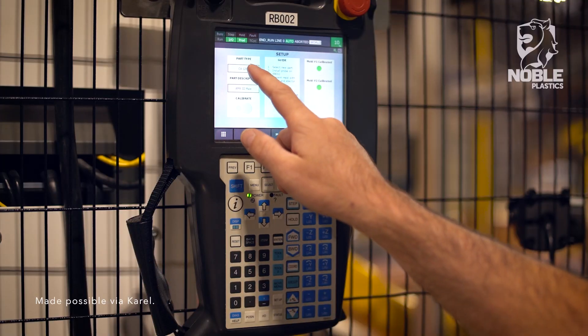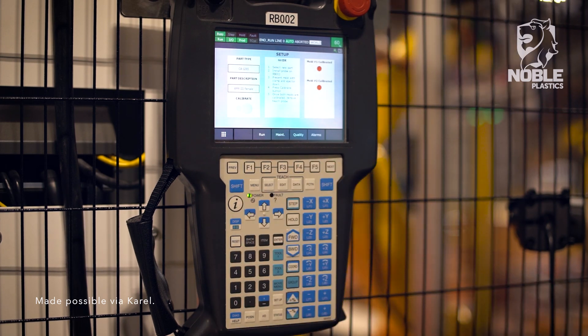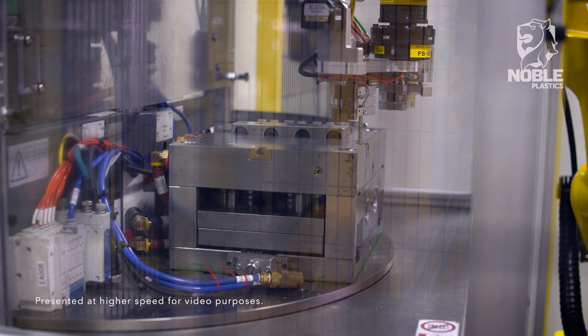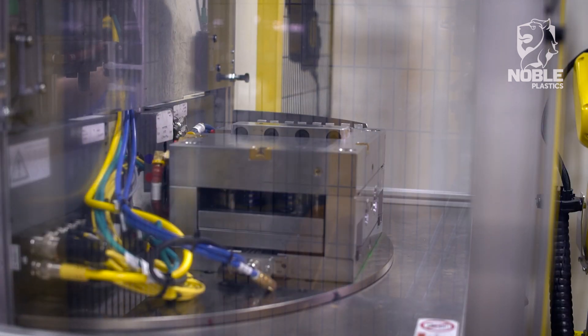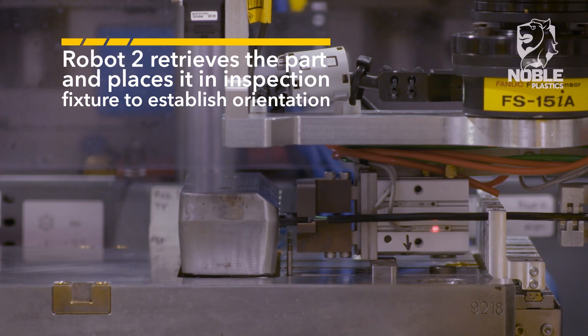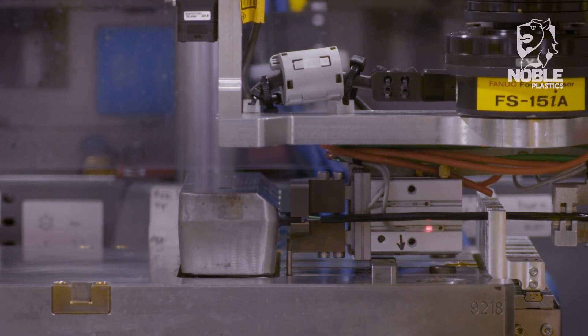Calibration of robot two pick and place positions after a tooling change is accomplished with an automated sequence. Following a mold and end-of-arm tooling change, the user installs a simple probe on the end-of-arm tooling, allowing the robot, through force sensing, to function like a coordinate measuring machine. The sequence is completed on each mold lower half. In a separate sequence, a substrate is placed in the calibrated mold, after which robot two retrieves the part and places it in the inspection fixture to establish a target orientation used for picking parts.